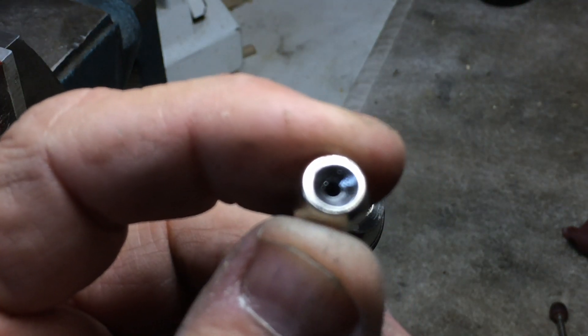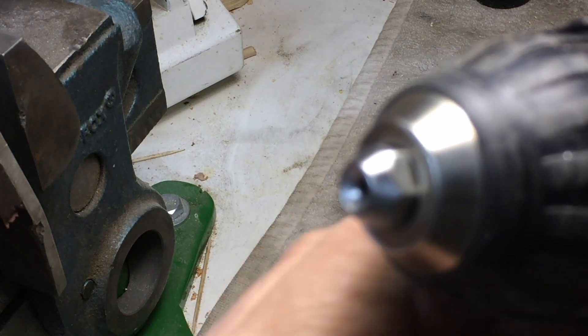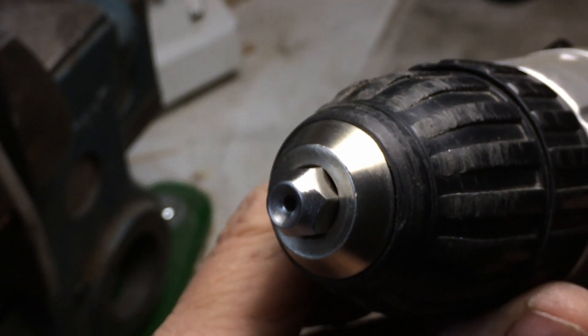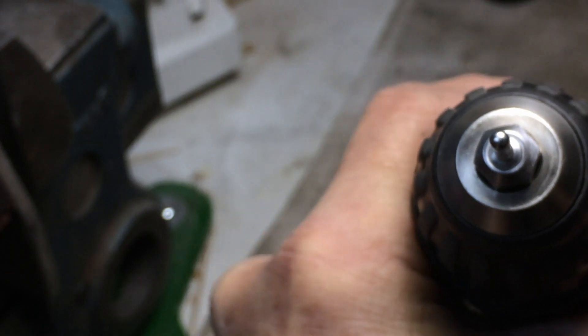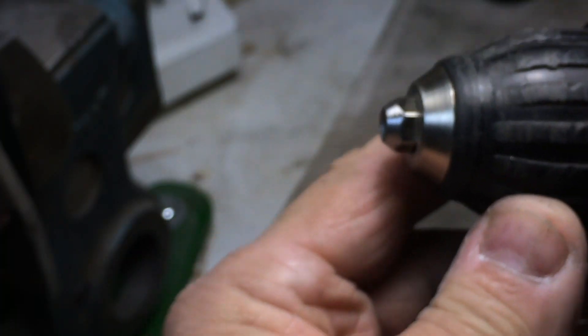I'm going to shorten this up on the belt sander as well. I took the head over to the belt sander and went ahead and shortened it up a little bit because I think it was a little too deep. Then I actually rounded the outer edges a little bit around here, because we don't need all that extra material hanging out the side for a little A4. We fitted it down so that it's just about flush — your base is just about flush. You may have to fine-tune these a little bit. Let's go ahead and stick it back in the rivet gun and pull a couple of rivets to see what it looks like.